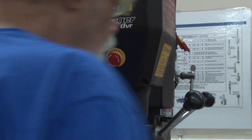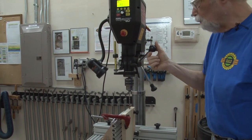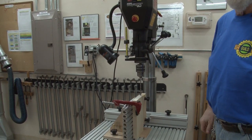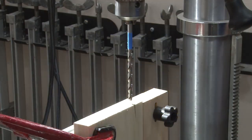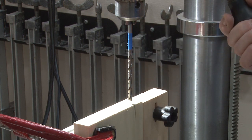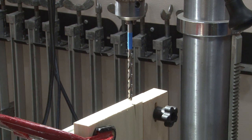Next is very important. When you go to drill, don't just grab here and start drilling. If you do, you will run out of runway — you will run out of space; your arm's going to have to be back here. So start out over here so you have a full throw all the way around. Lower the arm until the brad point of the bit is into the wood, then press 0 to set it to 0. As you drill, you can look at this dial and it will show you the depth you're drilling; when you reach the depth you need, back the drill bit out and you're done. The second method is by using tape on the drill bit as your depth marker — just lower the drill until you've reached that point, then back it out. It's your choice, whichever one you select.